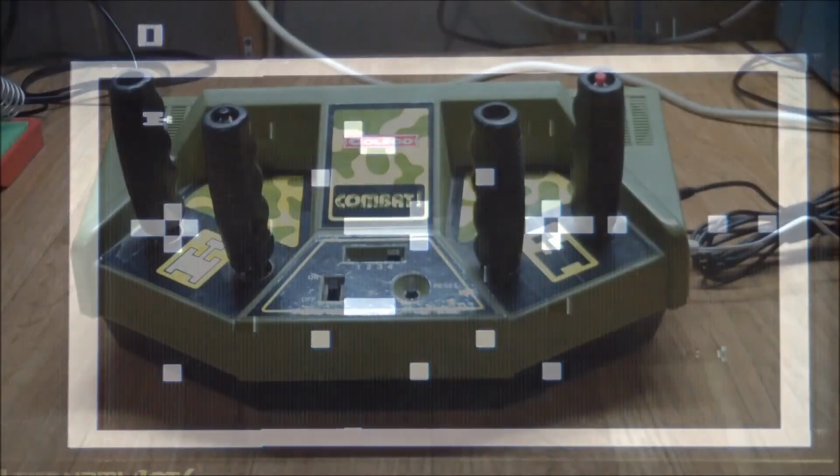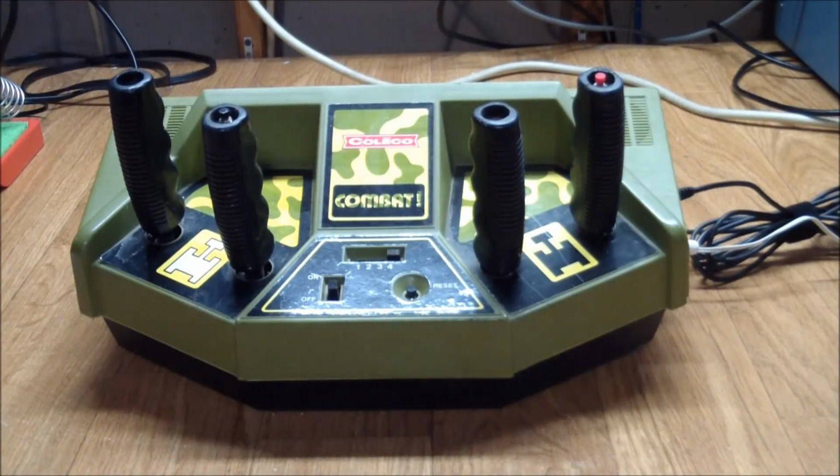Back to the initial game. The display's pretty good, but obviously with those two issues where it's not detecting collisions with the playfield frame, and where in the other games it's beginning to lose sync, seem to point towards a malfunction in the GI chip. So I think I'm going to stop here, because if in fact the chip has gone bad, I mean, it's not necessarily that the chip's gone bad, but we know that it's getting proper voltage on a clock, because it does show some of the game screens very cleanly before losing sync. And of course the big issue with it not colliding with white background on the screen.